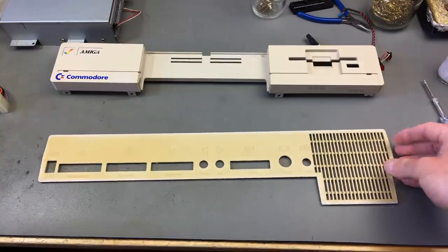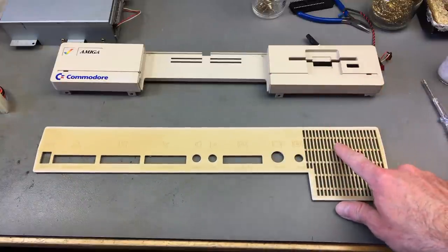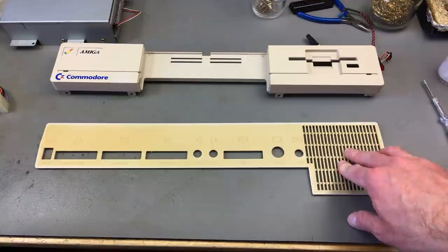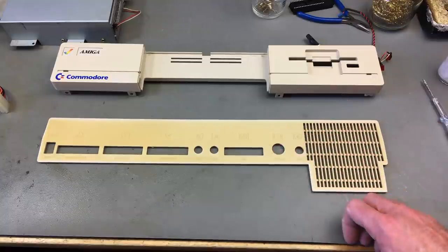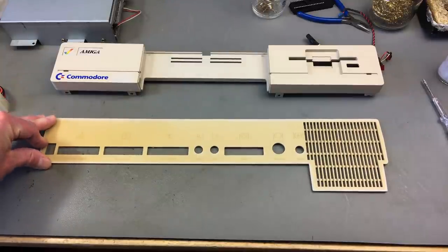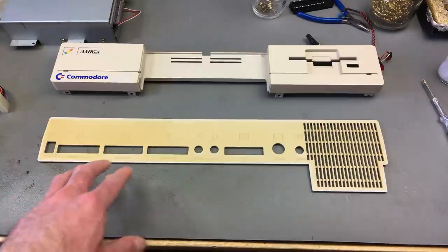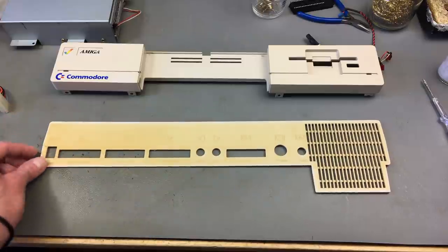This back part of the case, which just slides into the case, is the only part that's significantly yellowed. So I am going to try to retrobright this for a bit with my usual setup with peroxide cream and my grow light, full spectrum light, which isn't really a full spectrum light, but it worked for me. It does some significant heating of the plastics in my setup. I'm going to show you my setup again, which I've used numerous times now with great success, mostly.